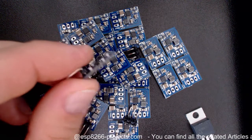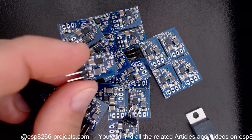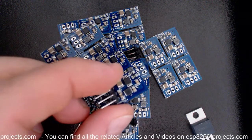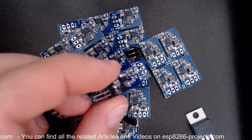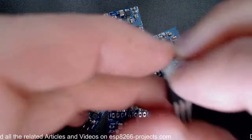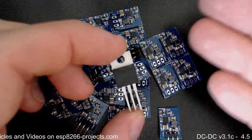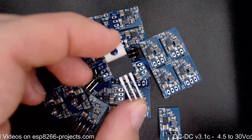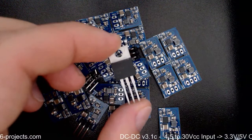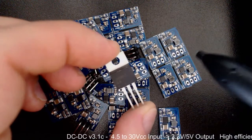In the past I was forced to use some industrial equipment for communication — basically some sort of network switches that were designed in a very strange way for industrial equipment. What happened inside was a standard linear regulator, and the problem was that because of the space, and maybe they didn't test it properly, the heat sink for this regulator was actually way too small to dissipate all the heat.